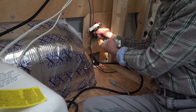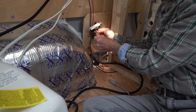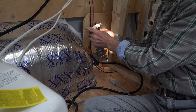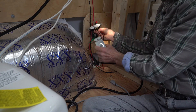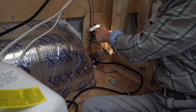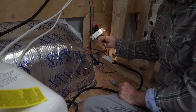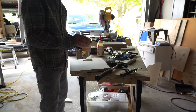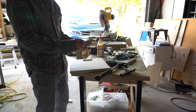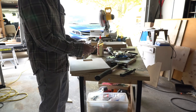Through a wire, the timer will be connected such that this connection picks up the power. I'm going to be running the power to this terminal, which goes through the timer and then powers the plug on the bottom — which the hot water heater will be plugged into. I'm going to be mounting my timer and using it to turn on and off my electric water heater.